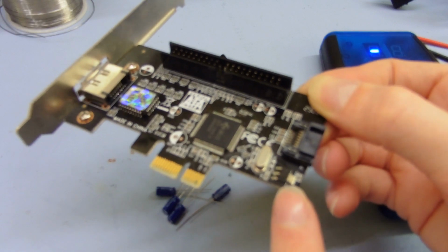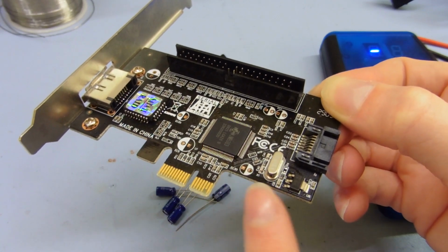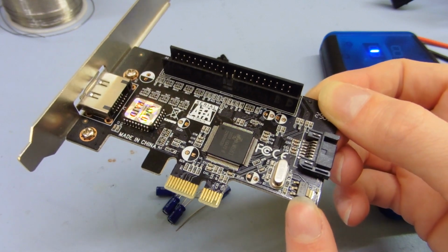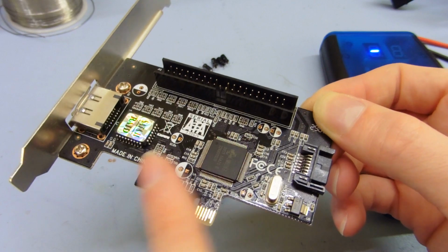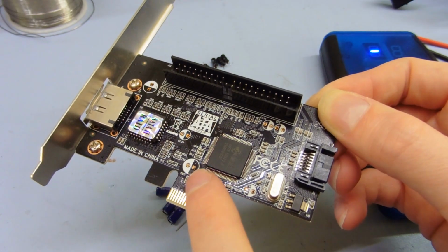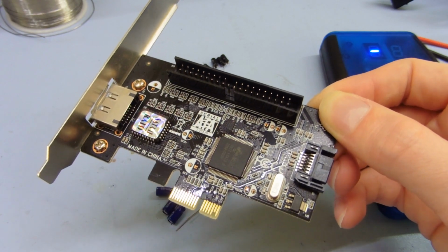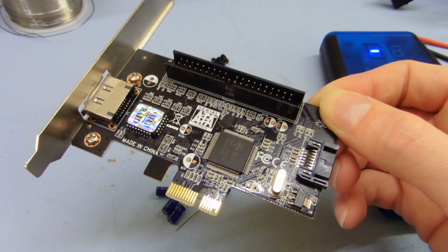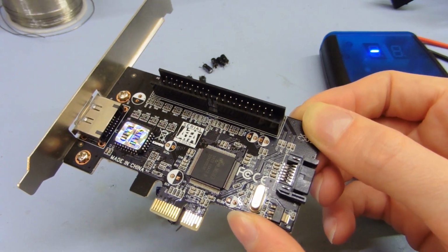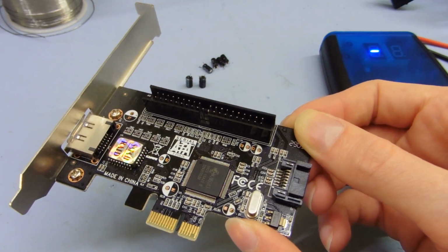If the voltage regulator is unstable because the capacitor is not good enough, then that could affect the operation of the card. That would make sense. So quite possibly that one might be the only bad one, all the rest were actually okay. The 100 microfarad one that was in this position was measuring 130, which is out of spec. Actually, it should only be up to 120 at plus 20%, so out of spec. It might be electrically leaky, I don't know. Replace it anyway.